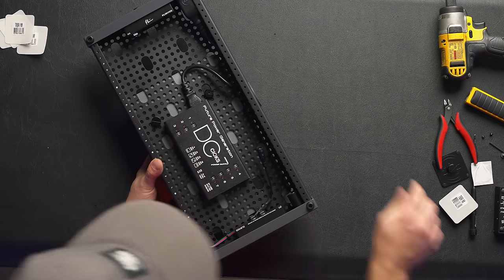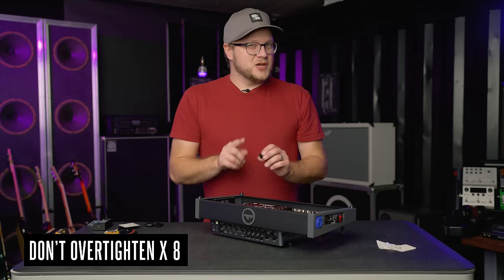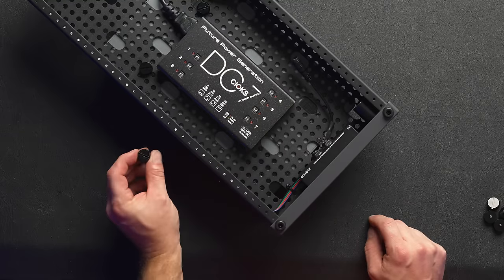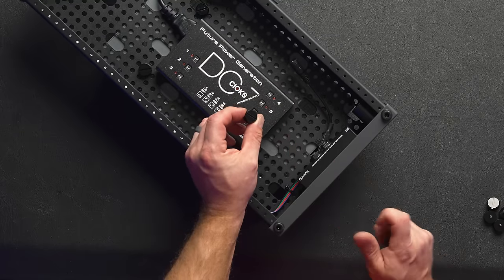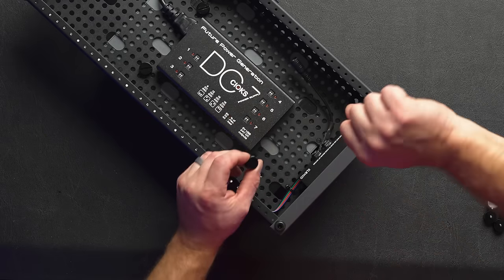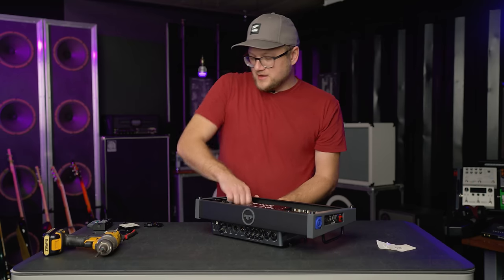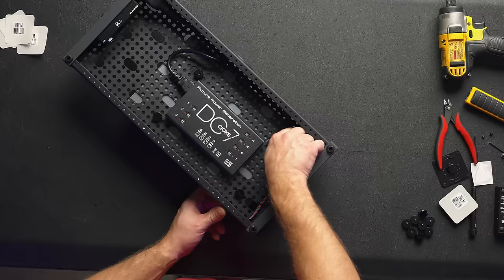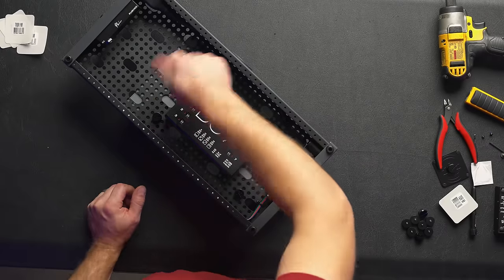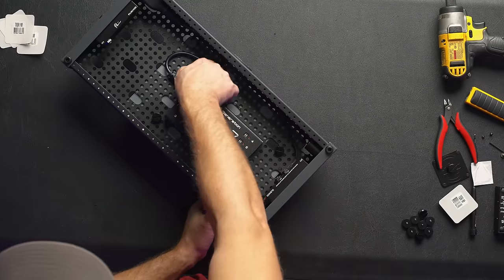So, thumb screws in. When putting thumb screws in, finger tight is plenty. You've got a slot, I don't know if you can see that on camera, in our thumb screws, which is for removing only. I don't recommend taking a big flat head or a quarter or something and tightening those. But if you've got one that is overtightened, and in a tight place, if you've got a thick gauge pick, you can use that to loosen it, or a coin of some sort. So just tighten it by thumb.